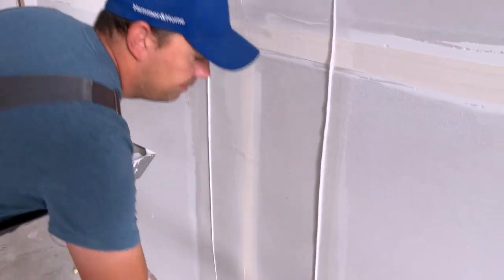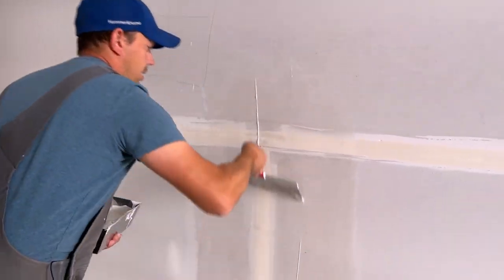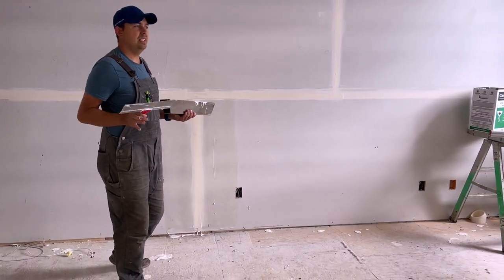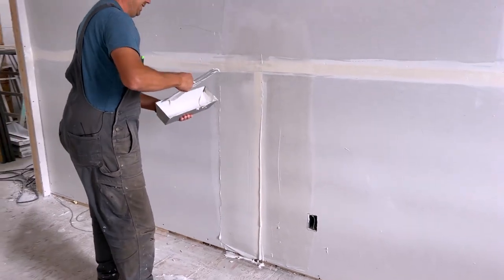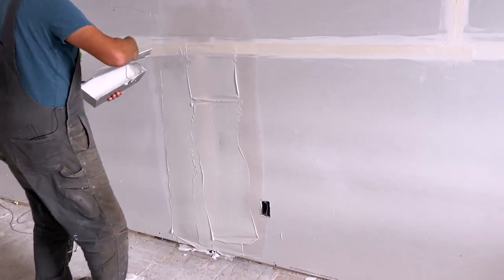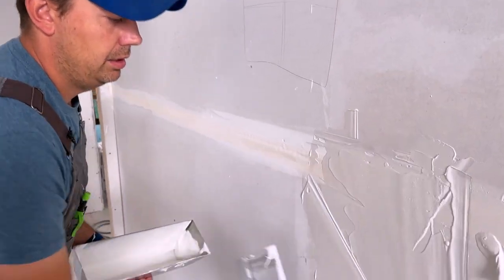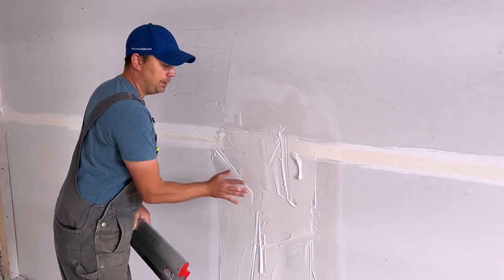So I'm going to take this mud off. The beautiful thing about mudding is you can just take it off and start over again — you don't want to, but you can. So let's do this again, but this time I'm going to apply the mud really messy, like as if I kind of don't know how to operate one of these. We'll just sort of slap it on there. So when you're doing butt joints you want to be really wide — you don't want to just do 12 inches because you want to be able to taper this out all the way.